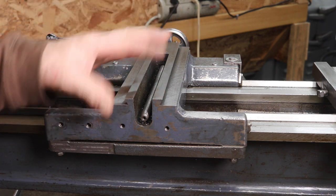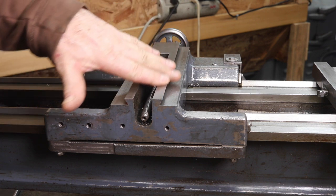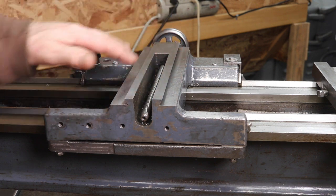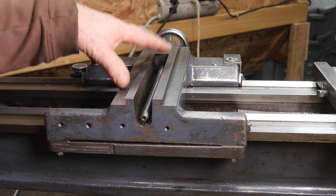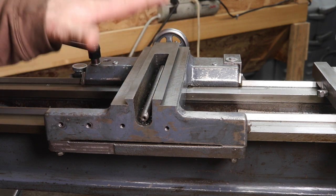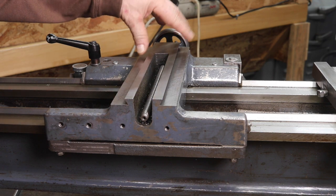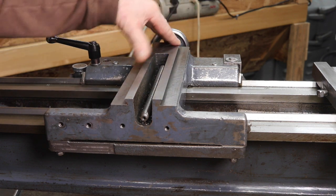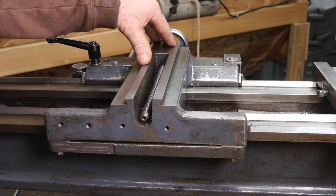This lathe was built around 1955–1956, so it's as old as I am — I was born in '56. It's in really good shape. I've had to make some new parts for it: a new lead screw and some bearings on the jackshaft. But it's a very good lathe, runs well, and I can do half-thousandths precision work with it. It's an 11 by 36 Logan lathe — a fun little machine. It's flat belt driven with only about a three-quarter horsepower motor, great for small work.